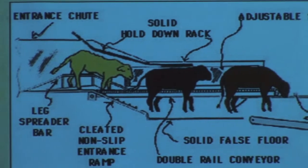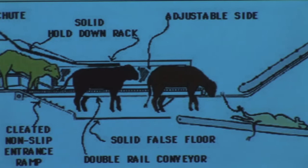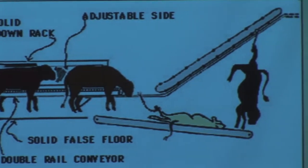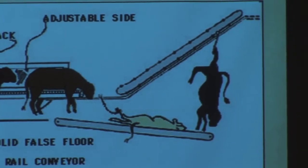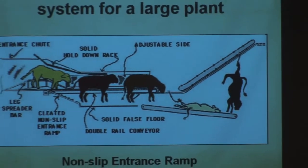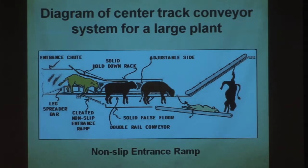It's driving me crazy! One of my best clients cut off three-quarters of the ramp, and the plant manager told me they hadn't done anything to it. I said, wait a minute, I'm going to go look. They only had this much ramp left — it's supposed to be that long. They'd cut it off, had to jump the cattle in, and it worked like crap. It's a hard concept to get across: using behavior rather than force.